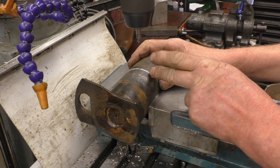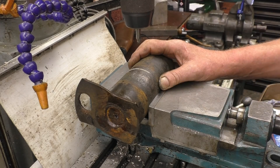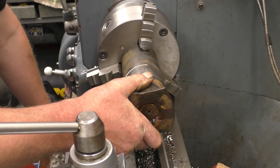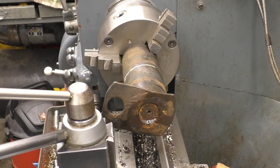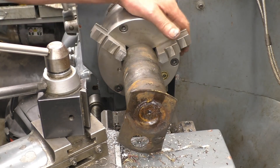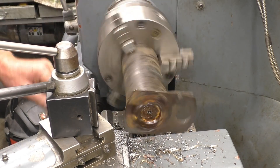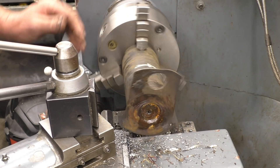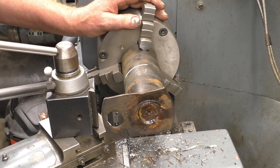I think what I'll do is put it back in the lathe and put a groove in there for the grease to come around, just to break through the hardness — it'll only be a case hardened thing. I'm going to have to be careful here for clearance, to have the cross side with that big bit. I could turn the compound slide across but I'm just going to put the tool in poking out the long way so we can get away with it.